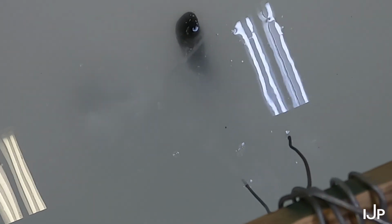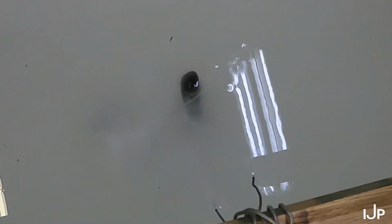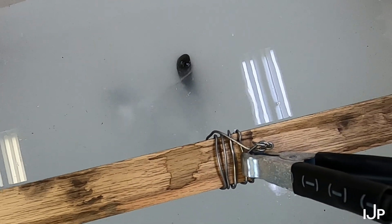That way it helps the electricity go through your part better. It doesn't have to try to knock all that old rust off. As you can see here, we do have some kind of action going on down in there. I don't hope it comes up on the camera, but there are bubbles coming up there. Now those bubbles are hydrogen and oxygen.